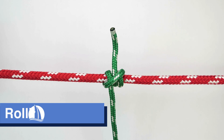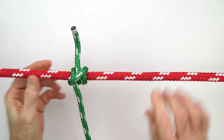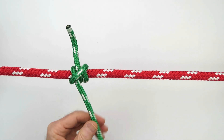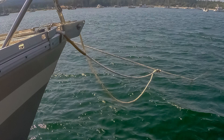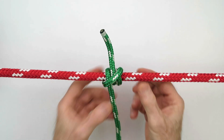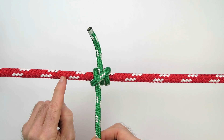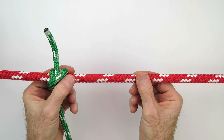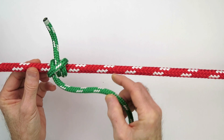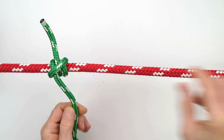The rolling hitch. The rolling hitch is a friction knot that slides along the line, but when you put pressure on the smaller line in one direction, it will put tension on the larger line going the other way. Most commonly used as a snubber on a nylon anchor rode, and also — probably more commonly — to clear an override or riding turn on a winch. So if there's a riding turn to my right, I would tie this line here — notice it's a bit thinner than the thicker line — slide it along, lead it to another winch, and put pressure on the green line. The green line locks onto the red line, which is the genoa or jib sheet, creating slack so you can clear your riding turn.